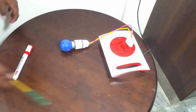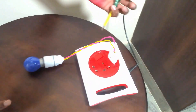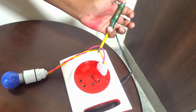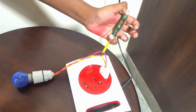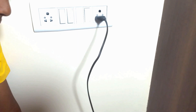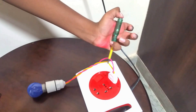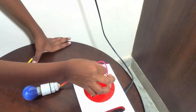I still have the same original circuit here — there is still current coming from the neutral wire. As I showed on the whiteboard, the way to fix this is to connect the switch in the phase line. Now you can see there is no current flowing, and I can still touch it safely.